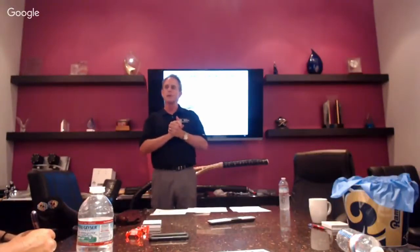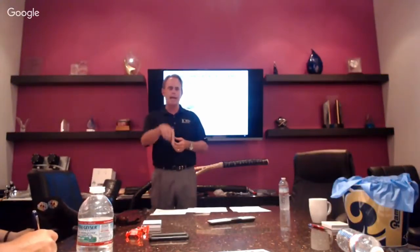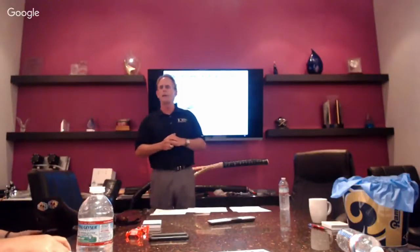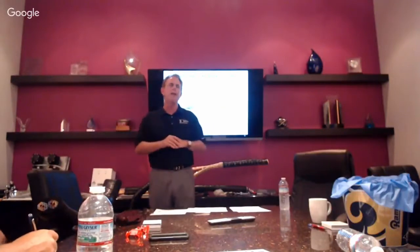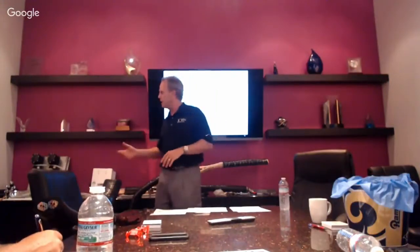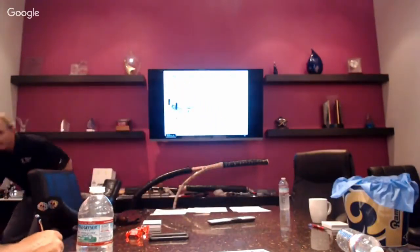What else? Back counter. You know, we want to come up in cabinets, so we can make our connections. It's not uncommon to see these stub ups coming up underneath a back bar refrigerator. Like, actually, I think that violates NSF. I don't know that you can run a drain line straight out of a cabinet into something like that. I've been told you can't. I don't know that for a fact. But let's just pretend now that the codes have nothing to do with it. And by God, that's what we're going to do. We're going to run that right. So you just lost this whole refrigerator door. It's gone because we're making connections, and you can't use it for anything else.